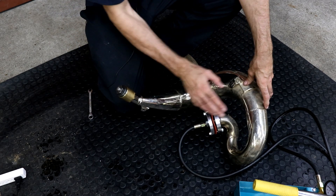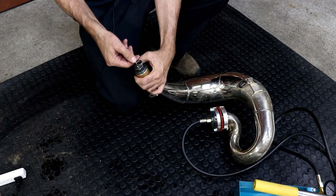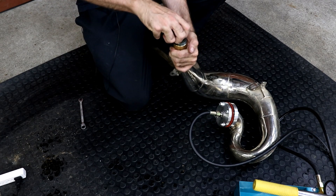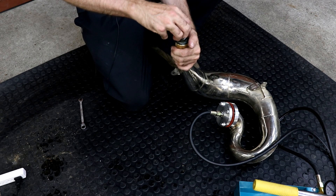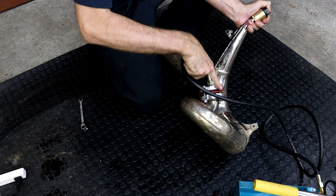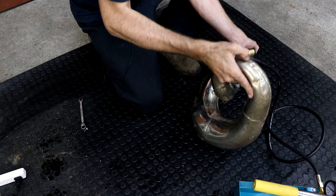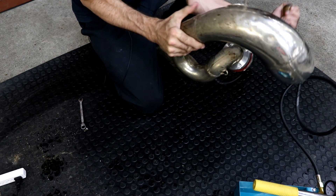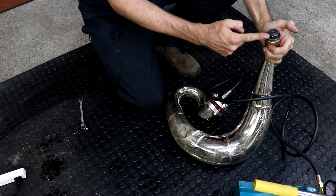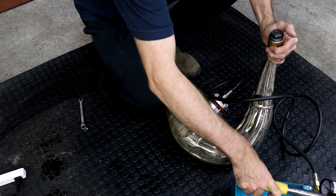I've got the bung mounted on the pipe and the pipe is actually full of water. I filled it from here and then put this bung on and secured it — both bungs are tightened. All I need to do now is bleed the air out, and as this is a very important step when using the HydraForce, I'll show it again. You want to make sure it's full of water, and when bleeding you can use your thumb to get the air out. Hold it up so the air travels up to the highest point, tip it round, then give a couple of pumps to fill it up with more water and repeat.